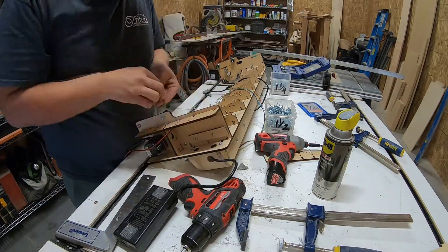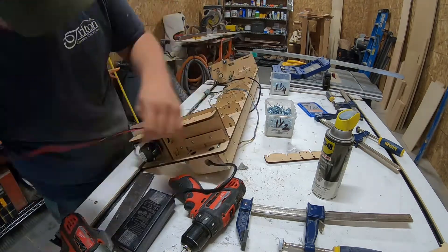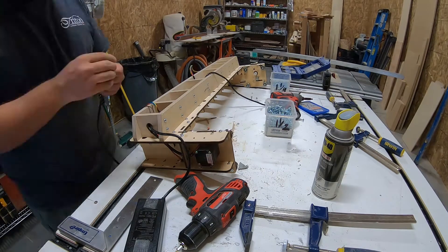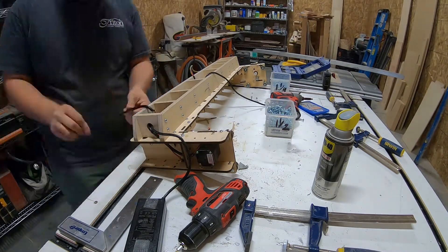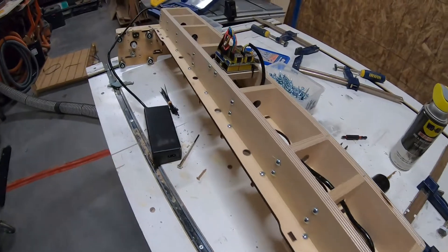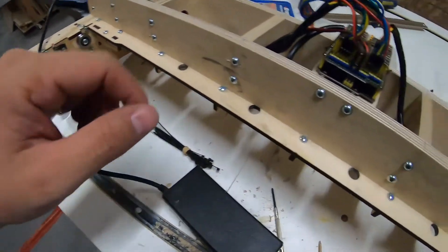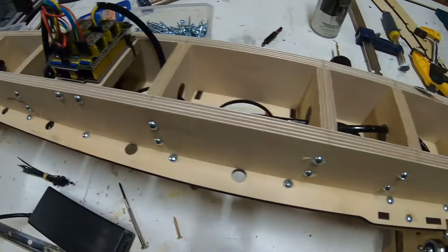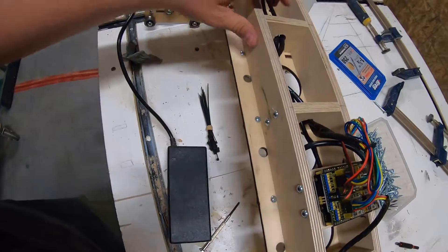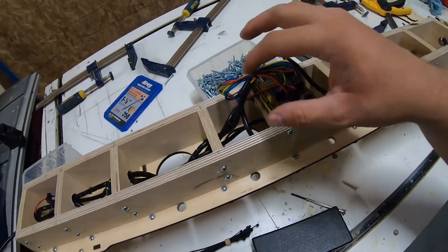Most of this, if I would have grabbed my angle head driver, I wouldn't have had to take that off. But you can see those screws are kind of hard to get to back behind that plate. Everything's been cleaned and lubed up. The Arduino has been mounted. One thing I will do is probably make some way to secure the wires like the stock configuration, because I've actually had issues with one of my limit switches coming unplugged.